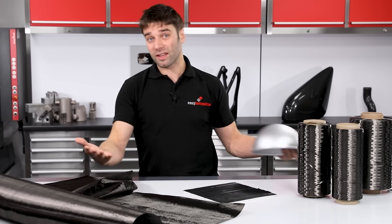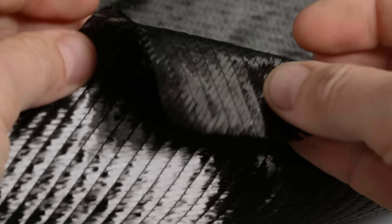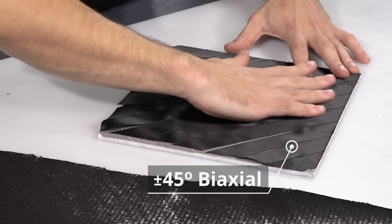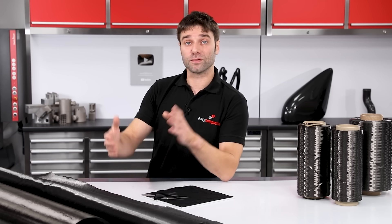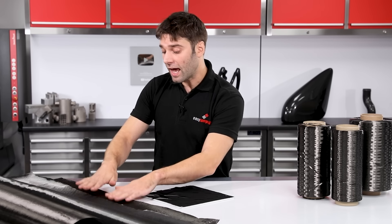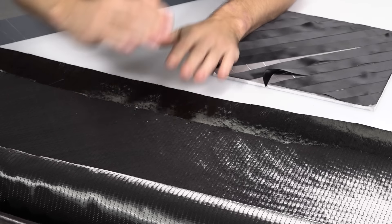Another variation is a multi-axial, which you can think of as multiple plies of unidirectional. This particular reinforcement is a biaxial with plus/minus 45 degrees — reinforcement running on the top surface at 45 degrees and then the opposite direction underneath. This type of reinforcement is particularly useful when you want to add torsional stiffness to a part. Other common configurations are tri-axials — combining a unidirectional with a plus/minus 45 degree biaxial — which are the reinforcement of choice in skis and snowboards where you want strength down the length and torsional stiffness, but stiffness across the width isn't that important.